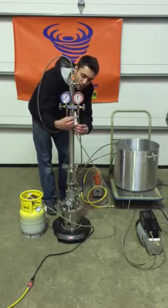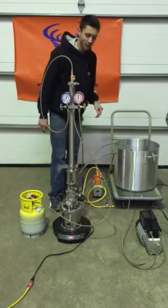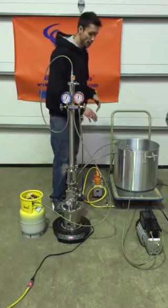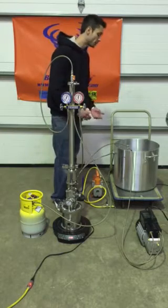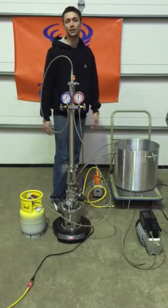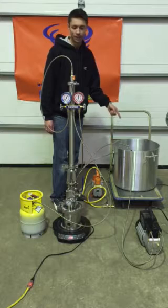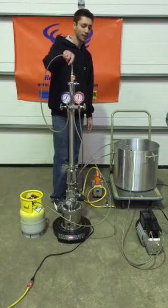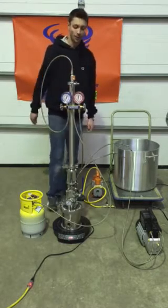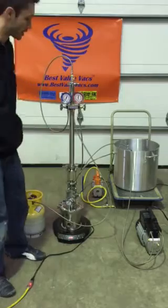Later we'll isolate this so the fluid flows right back up into the extractor. There are a couple of different configurations using the MT69 — you can cool it right as it comes out of the extractor before it gets to the pump, or you can cool it after the pump. I've tried both ways and seen a negligible difference. In short, the MT69 provides a good cool flow of butane. Without it, the pump gets hotter and hotter bringing in hot gas, and we don't want that. With it, the system gets nice and cold.